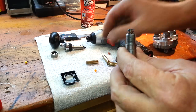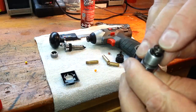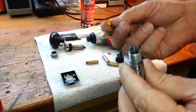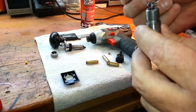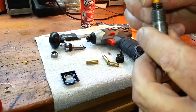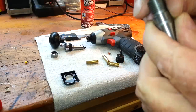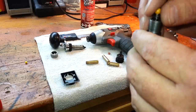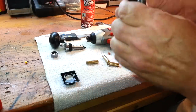So I've revised that since, taking some measurements. Actually, what would work well in here is a one-quarter inch ball — smaller than the 3/8, so an eighth of an inch smaller. What I found was that an airsoft pellet works — they're real close to a quarter inch and fit in there pretty good. You can see I'm engaging those inner springs but not the outer one. That equalizes the pressure and makes up for what was missing. It's a rig, but it's easy to do and it didn't take much to get this working really well.